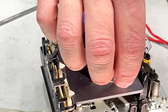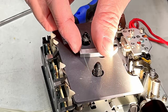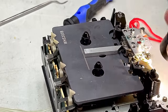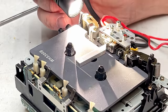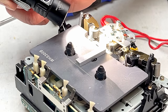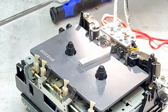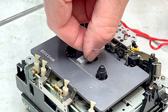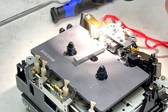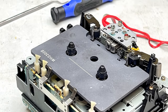All right, I think we got her. Gonna leave it for now. I want to check the head tilt and all that good stuff. Man, I cannot see this with the camera gimbal in the way. Okay, head tilt's good on the playback head, but what about the record? Because we got discretes here. Okay, that's fine too. I'll just check the guide. And we are wavy gravy on the guide, so we're fine. Now, if I can find my glasses again, I'm gonna paint lock that